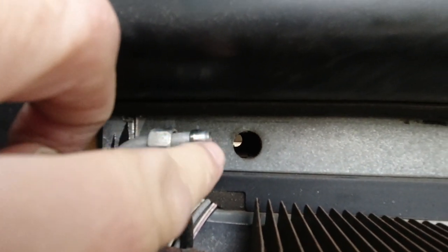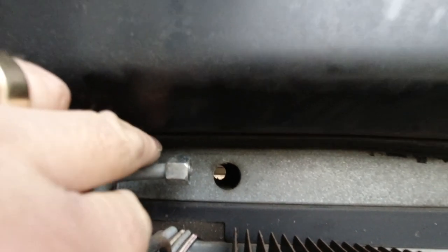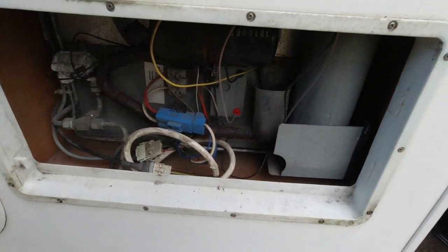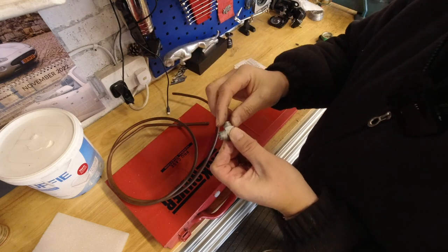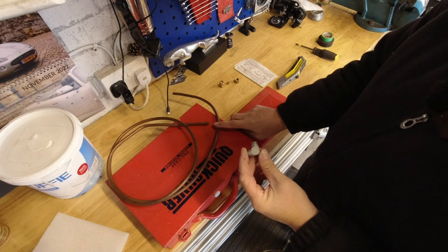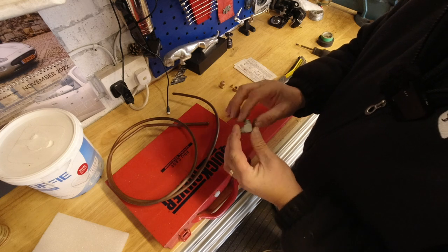This is where the gas pipe went through a 90-degree bend and then into the back of the oven. It's critically important that this is properly blanked off to keep things safe. Yes, it's in an outdoor vented area, but gas falls — it's going to fall down, and you've got a naked flame nearby. It's really important you get this capped off. This is the elbow that came off with the oven. I'm going to refit it in case anything is ever reinstated. I've got some 8mm copper pipe and a couple of unions and olives — I'm going to make a straight extension with a blanked end to leave it ready to receive an oven in future.